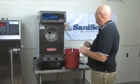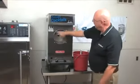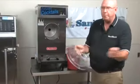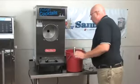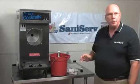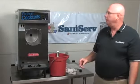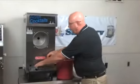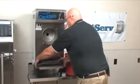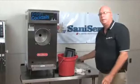You need to get mild soap and water and clean out the top of the machine, clean out the barrel. To get this O-ring off, just a smack on your hand, it comes off. All these parts go back into your kitchen. Wash them with a mild soap and or mild detergent and lukewarm water. Let them air dry, and they'll be ready for assembly the next morning. The knobs go. Drip tray goes. And the lid goes. That should be it for cleaning your machine.